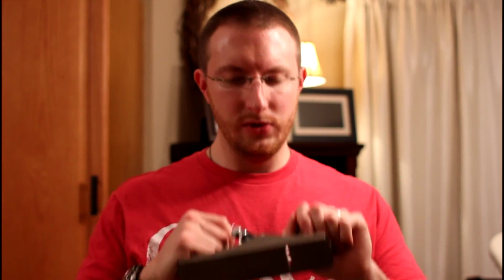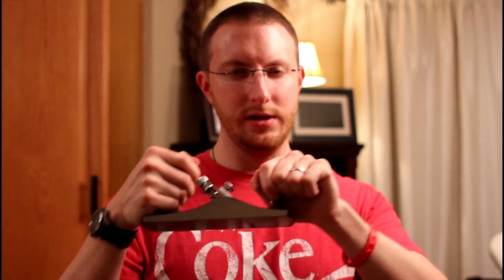It seemed like it was decently sharp, so I sharpened it again with a hollow grind on my bench grinder and hit it with some Norton wet stones, like a 220 grit, and then I think it was 1,000 grit, and I did it by hand. And still, when I would use the plane, I would come across and it would chatter. So I put it away. Haven't thought about it, and this was probably a year and a half ago.